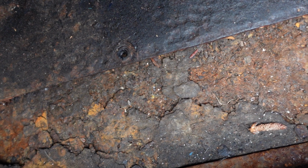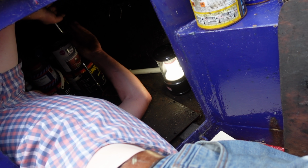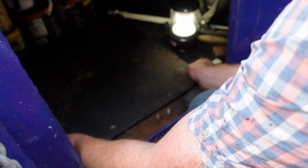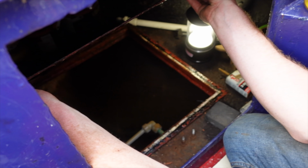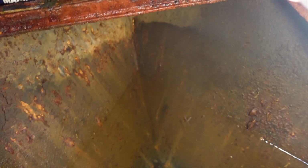The leak was caused by the hot water tank. Having said that, we did discover one problem with the water tank, which actually, when we had someone more professional involved, we realised we could in fact access the water tank through that hatch. There was just two really thin bits of metal bolted together, so it was hard to see the seam. So once we had access to the tank, we realised that the ball valve had broken.